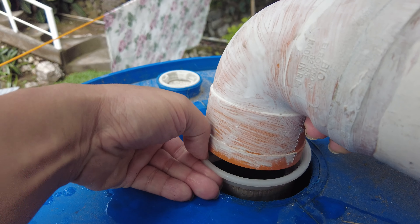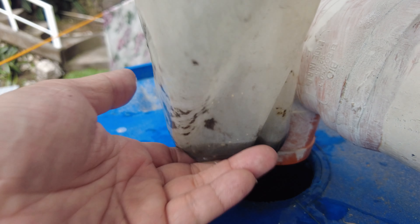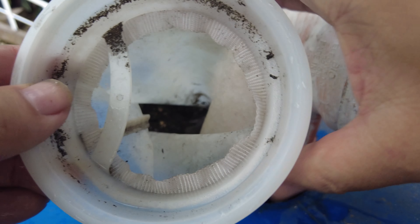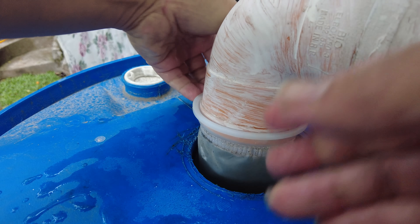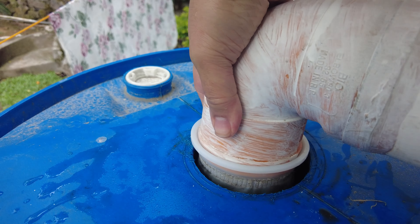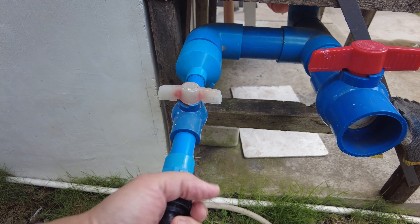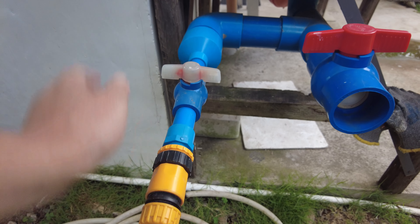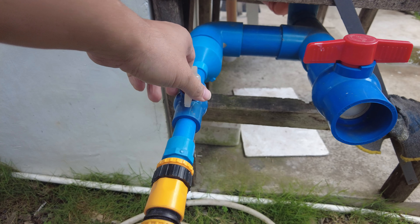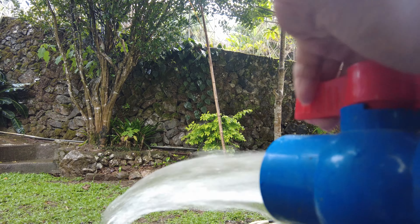Over at the top, I got this filter-on line which fits my downspout perfectly. Occasionally I need to clean it out of all of the dust, leaves, and pine needles gathered from the roof. My smaller 3/4 inch spout has a 3/4 inch threaded fitting, so I can screw a garden hose to it, or in my case, so I can screw on a Toltzen Quick Release Tap Adapter. And if I need to fill out a bucket quickly, my 2 inch spout is definitely up to the task.